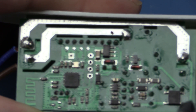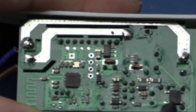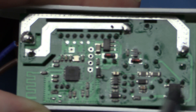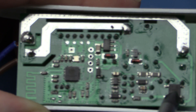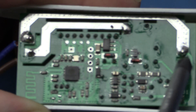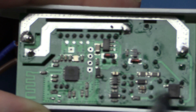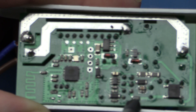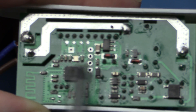You've got other miscellaneous power supply circuitry - there's a rectifier. This is obviously powering itself from the mains so there is a power supply built in to generate the 3.3 volts. This is the actual rectifier over this side because this is the input. The mains is coming this way across and then the live is switched over and comes in from this connection. You've got mains rectification here and then on the other side you'll see some capacitors and switching circuitry and then it's powering the ESP chip right here.